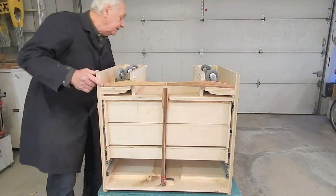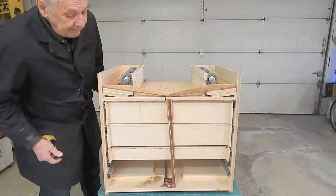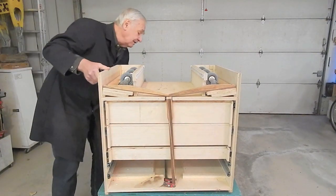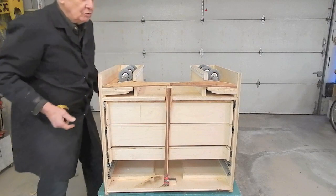The back of the drawers and the floor of the drawers are exactly one inch from the inside of the cabinet to make room for this push rod and the linkage. On the front of the cabinet, I've got a handle to rotate a rock shaft and a short arm that acts through a push rod to extend the casters.